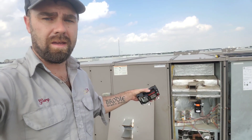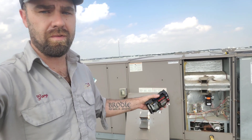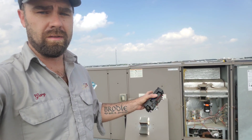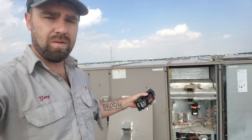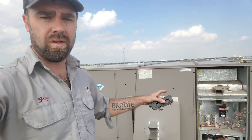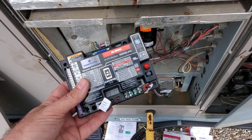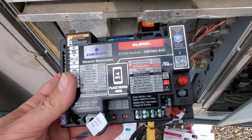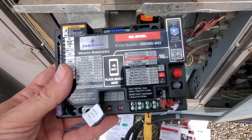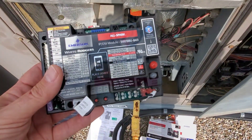What I did with this one is I counted the pre-purge seconds and it's about 15 seconds. So we're going to set it up for that, and I know the existing module in there is actually continuous tries for ignition. With near-field communication on and your phone, we're going to hold the phone close to where it says 'place device here' and once you do that, we're going to connect up to the app and see the setup screen.